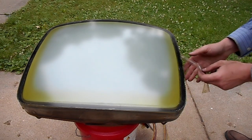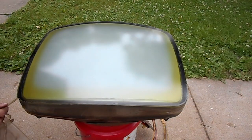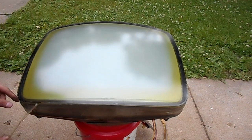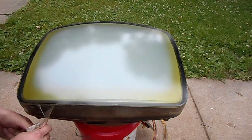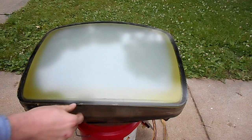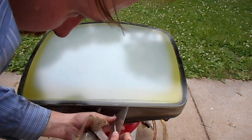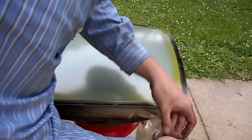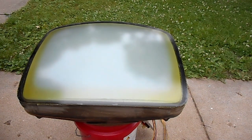Now, before the cataract removal can be done, the tape along the perimeter of the CRT needs to be removed. Doing the cataract removals on these Zenith CRTs is really nice. I've never had a circumstance where I wasn't able to get the safety glass off intact and reuse it on a Zenith style cataract. RCA cataracts, if you're as impatient as I am, are tricky to do without destroying the safety glass, which, if it happens mid-removal, which it usually does, makes the process of removal quite hellish.